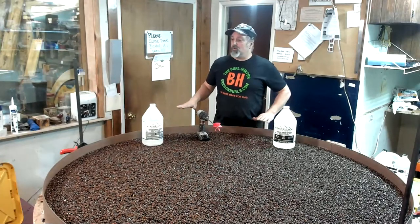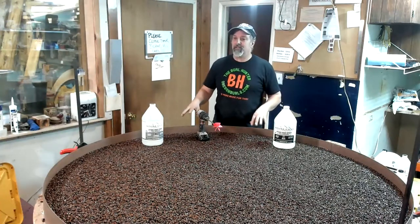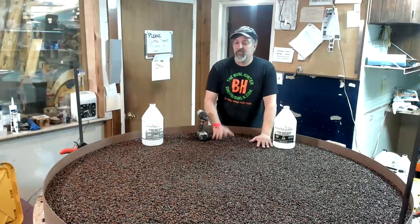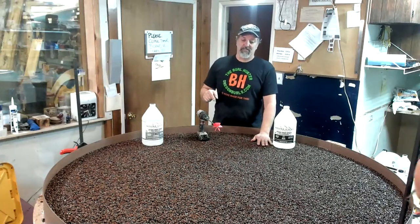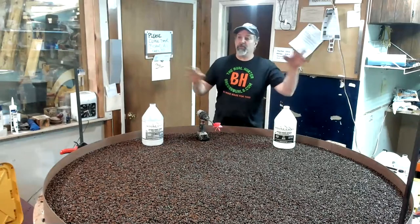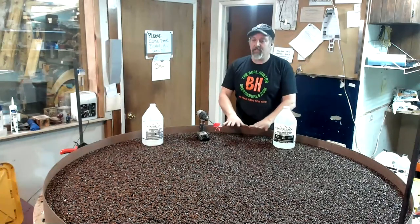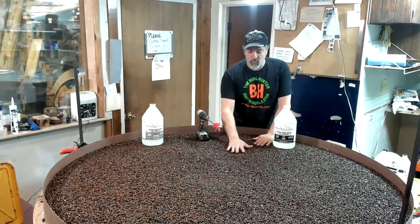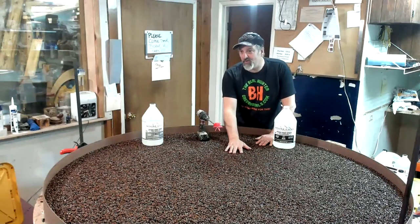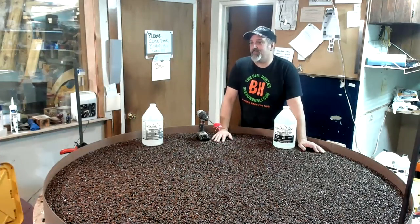A couple of days ago, we made the form. We poured 1/8 of an inch of epoxy, just epoxy, on the form itself. Then we made this big cookie. This big cookie is about 2.5, 2¾ inches thick. But in the center of it is a foam core. It's high density foam that we drilled a whole bunch of holes in so that when we do this major pour, it goes through the holes into the bottom, which is actually the top. And once it won't absorb any more epoxy, that means that we are full. In theory, only after we demold it will we find out if the theory is correct.